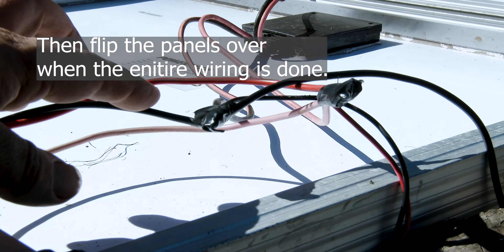I've already got this pre-wired and I'll just explain everything. You need to run the positive red cables to each solar panel, wiring them together, and all the black cables together for each solar panel — that will be your negative. That's parallel wiring.